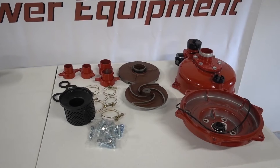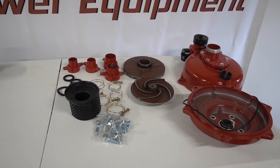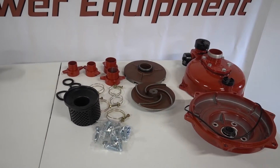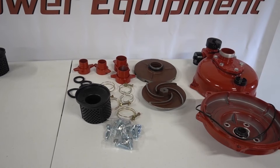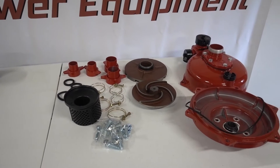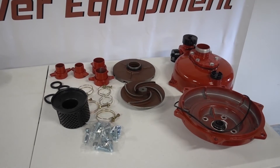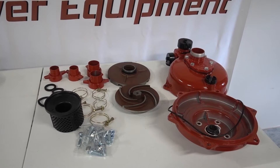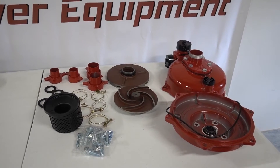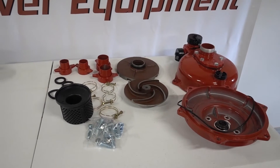A pressure pump won't produce the same flow of water as the other pump. This pump here is capable of about 3,700 gallons per hour. It will lift 262 feet, so it can actually lift higher than the pulley pump. The maximum suction is about the same at around 22 feet.